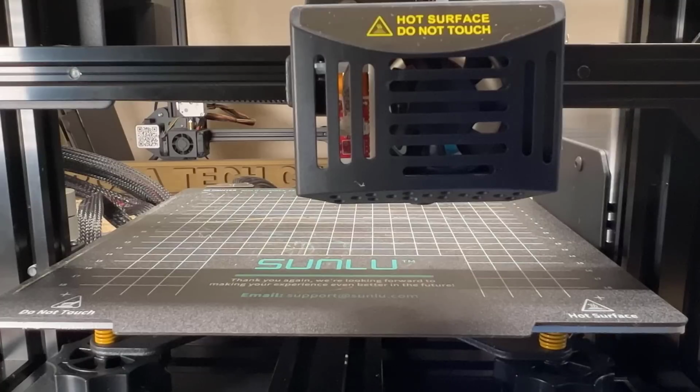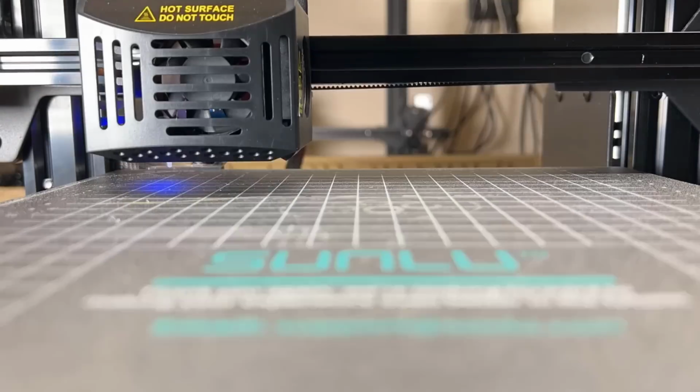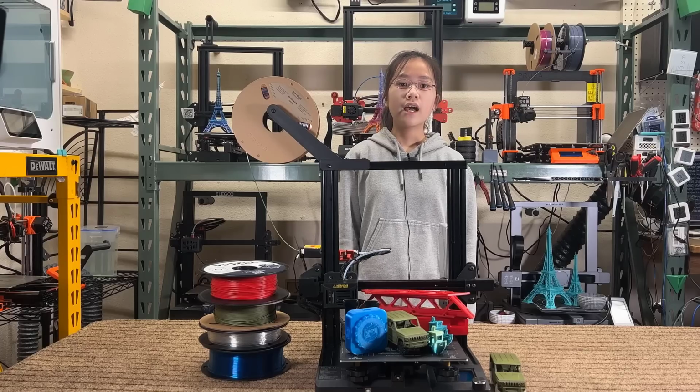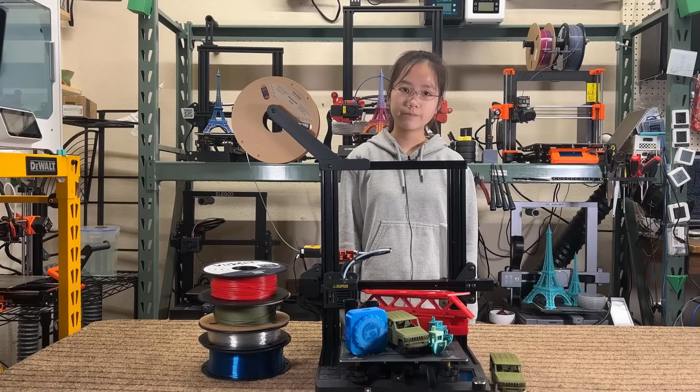2. The 3D Touch bed leveling sensor on my unit was dead before I completed all the test prints. However, I replaced it with a $10 3D Touch and it is now working fine. I have installed several 3D Touch sensors on different printers, and while they may not be as accurate as a genuine BL Touch, they tend to be durable. So, it is possible that receiving a defective 3D Touch is a rare occurrence.